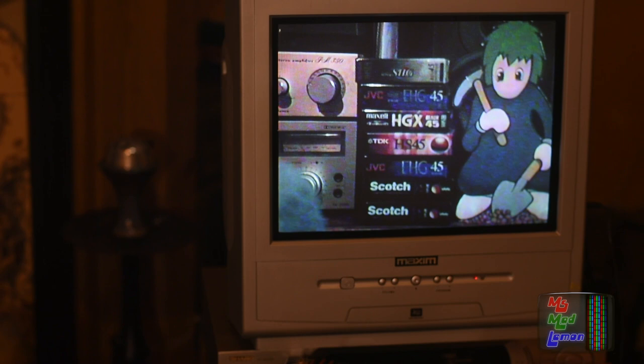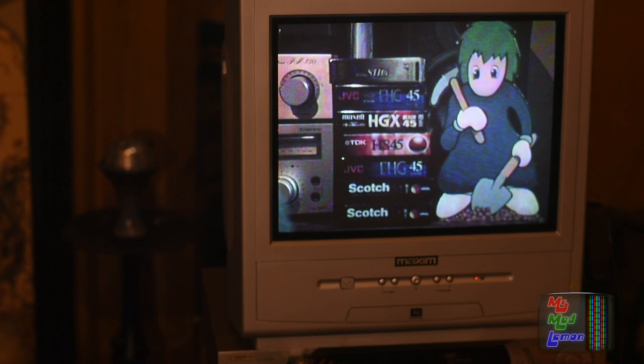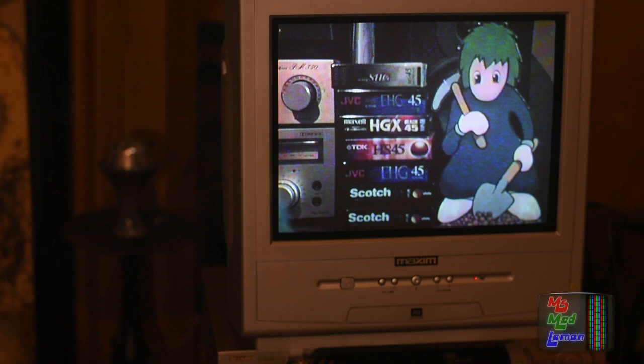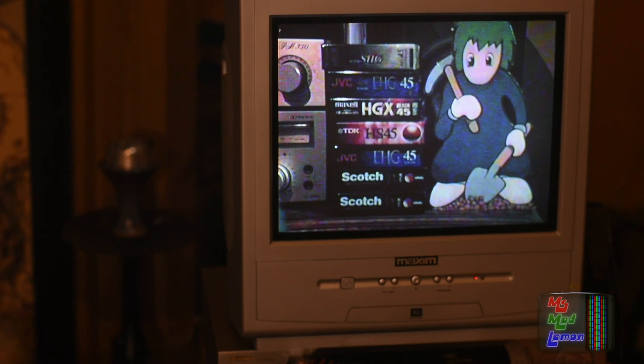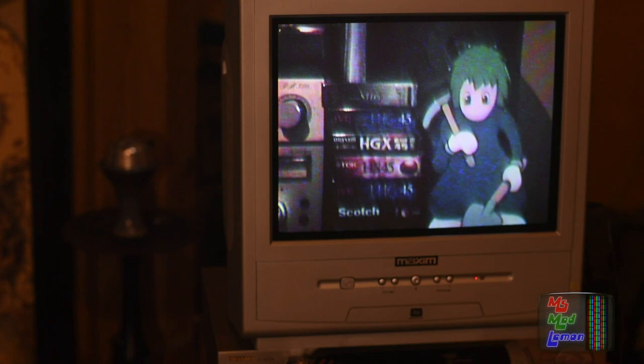I'm actually quite excited because the Hitachi one, I was thinking, okay, what's up with it? I mean, sometimes these settings drift. And to be honest, they weren't that hard to get to as I had expected initially. It's the nature of analog, things drift. And of course, these two things need recapping. With the capacitors over time, they start drying up and values change. So things drift, settings drift.